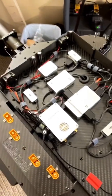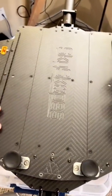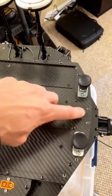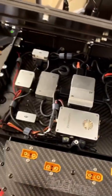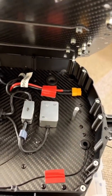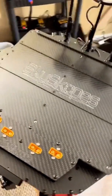Now that the electronics have been placed and the wires tidied up, and the battery connectors are all in, the finishing touch is to put on the battery plate right here. This has the quick release battery mechanism with the rails. It's about a dozen bolts that go on to attach this onto the aircraft. The bolts are red in color so that if the user ever needs to get to the underside and access the electronics below, they just take out the red bolts and have full access to the flight controller and computer underneath. I also gave them a 50-volt out — a 12S output — so if they ever want to hook up a DRTK or a regulator or whatever else, they've got a spare 12S line coming right out from the batteries.